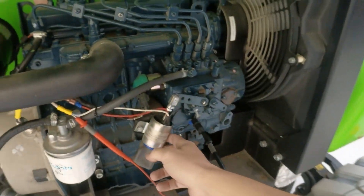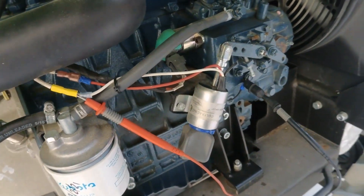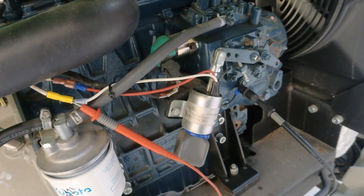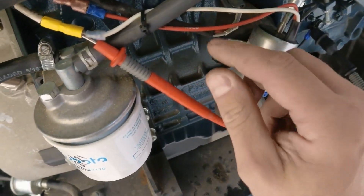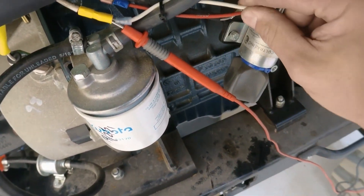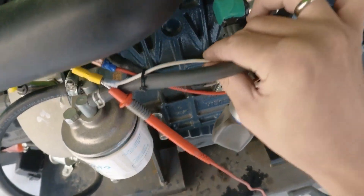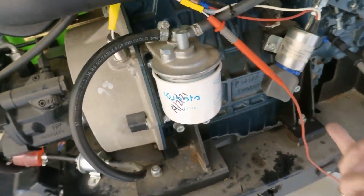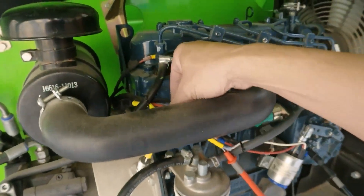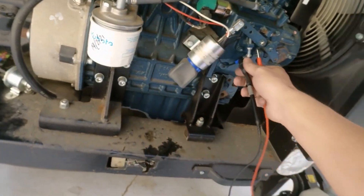So that's the way it should be. Someone was possibly trying to work on and fix the problem but somehow swapped the solenoid wires. The markings are on the wires — one says 'hold' and one is the pull side. It's not easy to see on camera but it is on the wire. Always, the pull side is going to be heavy current feed, so the cable feeding that side has to be the bigger cable.